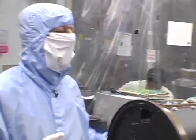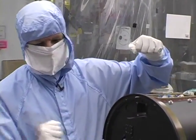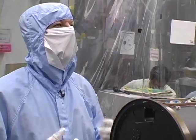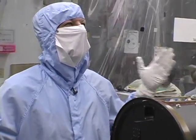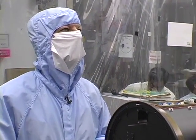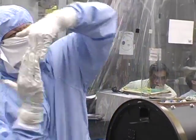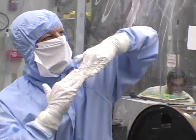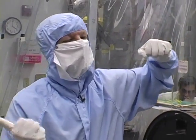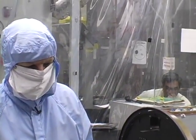negative means you're moving that way here. When this pulls this way, it moves the CCD the other direction. So negative means you increase the distance between the mirror and the CCD, so you increase focus length. You pull this way, but in the camera you've got a wedge, you've got a lever. So by pulling it that way, the CCD goes this way. So negative increases focal length.